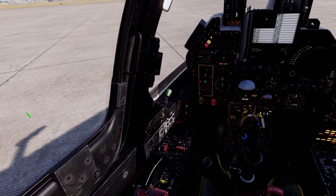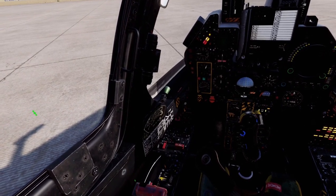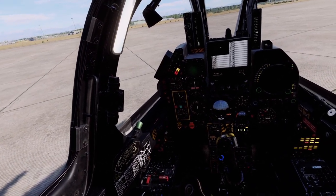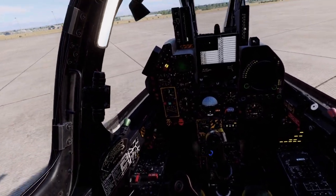The manual says 300 RPM, but what I do is right after 100 — around 150 — that's when I go ahead and set throttle to idle, otherwise the engine will just die and you have to start all over.